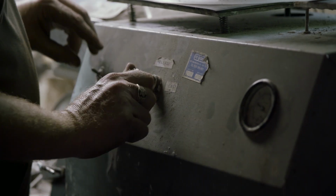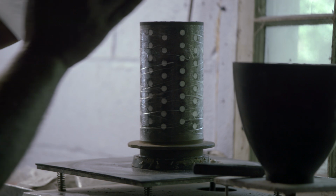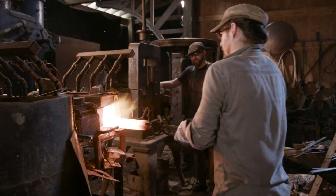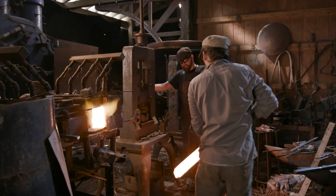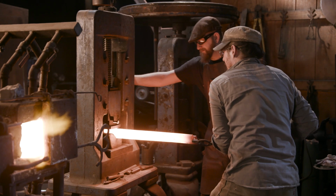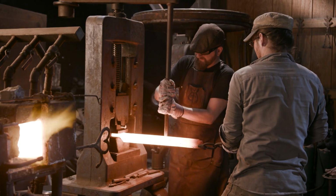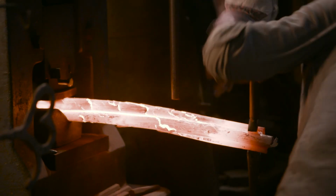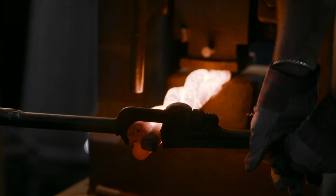Once that sets up, we'll be able to go to the kiln, melt the wax out, and pour in the Britannia melt. Matt and Ilya now twist the 3 bars together to create the handle section on Soul Edge. This is fairly difficult. These are solid pieces. They'll be using large wrenches, twisting this around. We'll then have to form this piece and create the pommel as well.